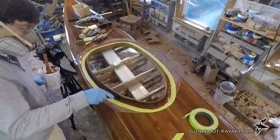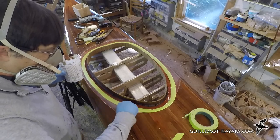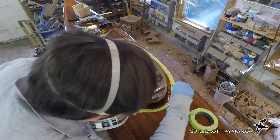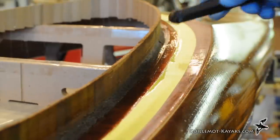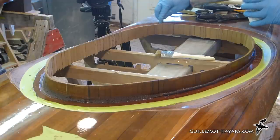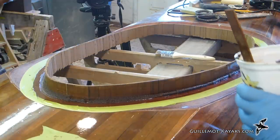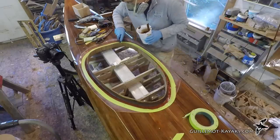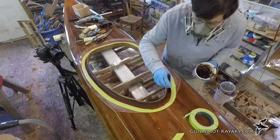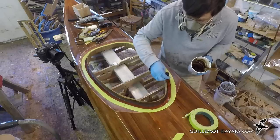The fillet is shaped using a tool with a nice radius at the end — this could be a tongue depressor or a plastic picnic spoon; I am using a little plastic spreader. I find I get the smoothest fillets when I use a long uninterrupted pull with the tool. Every time you start and stop, there will be a little bump. After the fillet is shaped, I come back and clean up any excess schmutz on the deck or riser, being careful not to poke the soft fillet.